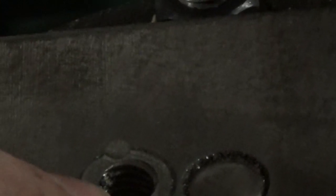I think I tapped that. It's about 9/16, and I've counterbored a little bit, and I've left a little bit of thread on there, a little bit of a shoulder on the outside, so it screws in nice and tight. And I put a bit of Loctite on it, and I put two 3/16 Brako pins down the side like a Scotch key, so that's never going to move. Put it all together with a bit of Loctite, and I'm pretty pleased about that little repair.